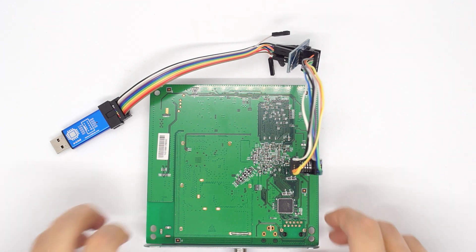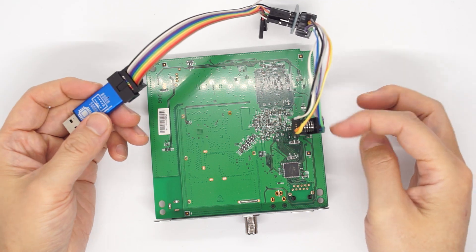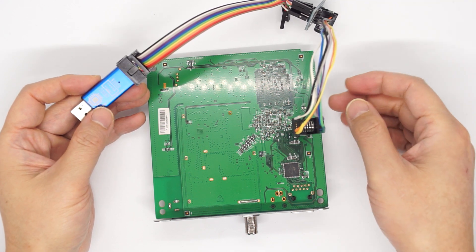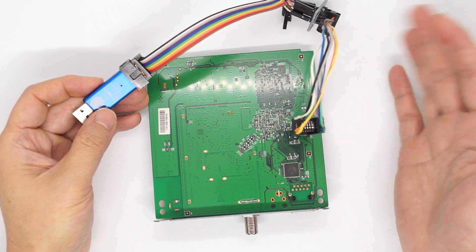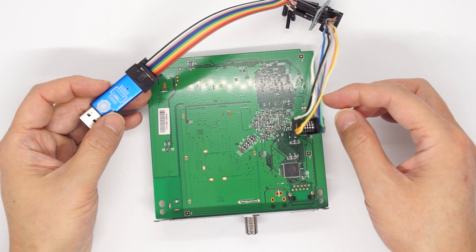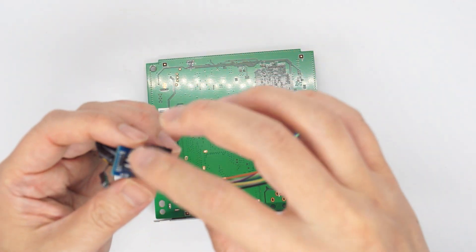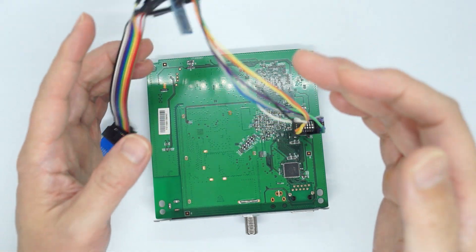This is how U-Link NT is connected to the modem, using the 3.3 volt directly from U-Link NT to the modem. The voltage is slightly lower — only 3 volts — but it gets the job done and is still working. If you find this does not work or the voltage is too low, consider using a better power supply such as a battery or a good external power source.